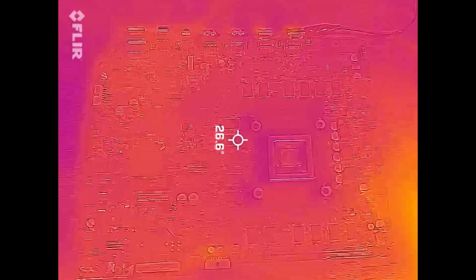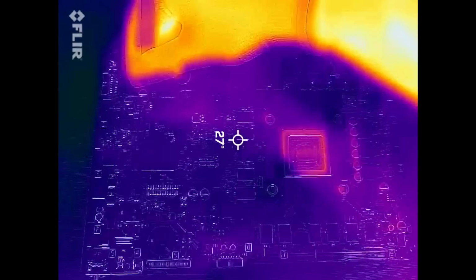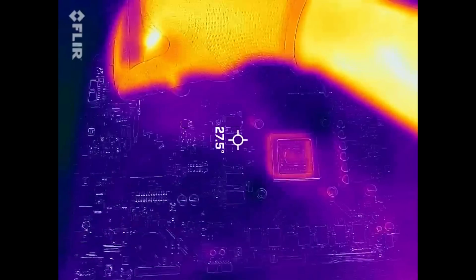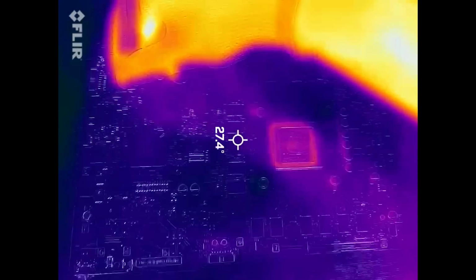Again, I've got 1 volt and a max of 1 amp. I'm going to put it onto the 3 volt line. Do we see anything getting hot? How many amps are we drawing? Okay, so we're drawing 0.036 amps, which I don't think is enough to make anything hot.